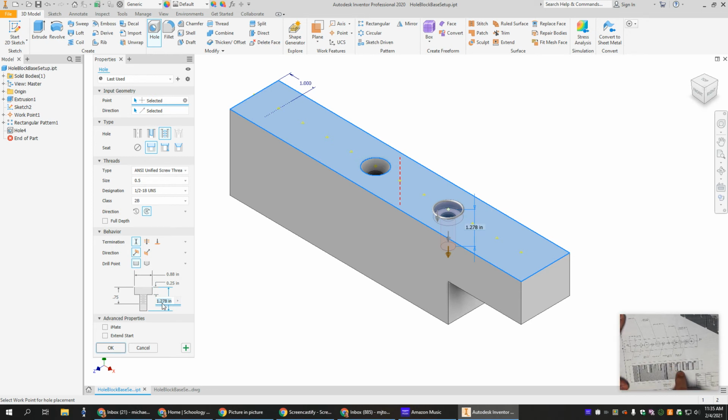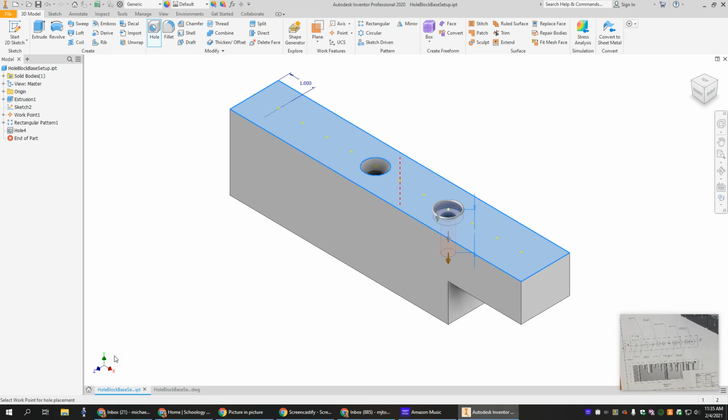Okay, the next thing, it doesn't tell me the depth of the whole screw, but we know this is 1.5 and it's the same depth as this little shelf that we're working at. So make the main depth 1.5. Okay, the only thing we've missed is, this has the pointy bottom, not the flat bottom. So we gotta go do this here and do the angled bottom. Now when we look, I think we have everything set. So we're gonna say, okay, I'm just gonna finish because this is my last example. So I'm gonna say, okay.